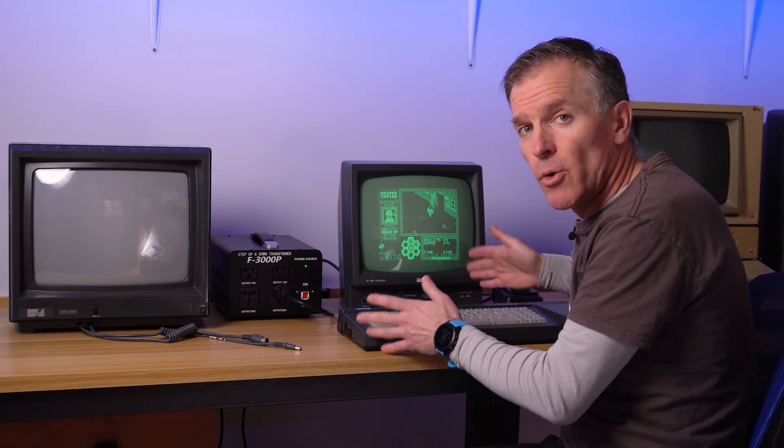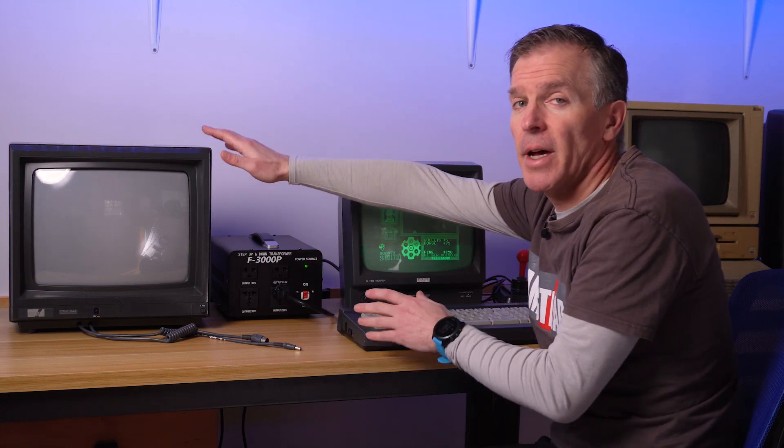A lot of you probably know that Adrian, over at Adrian's Digital Basement, is quite the CRT expert. I talked to him about this case and he suggested converting the whole monitor to run on DC voltage. It's true that the main monitor functions run on just 12V DC, so that could be really interesting. I wonder how many amps it requires — it could be an interesting conversion using something like a Meanwell power supply, getting both 12V for the monitor and 5V for the computer, while externally looking exactly the same. I'm very glad how the monitor turned out; it's really nice and usable now, and this was a great warm-up to fix a completely dead monitor at a future date.